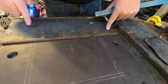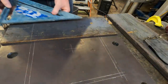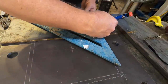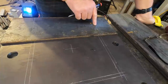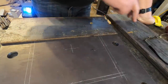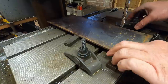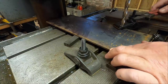I'm going to drill a quarter-inch hole halfway down — let's mark three inches — that's the top of my notch there. I'm going to drill a quarter-inch hole here and here, maybe slightly oversized, and then I'm going to bandsaw out this notch. I'm going to do all four pieces so that they nest on top of each other — two pieces here, two pieces here.